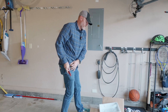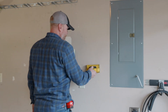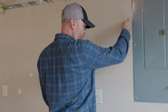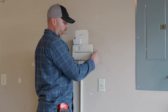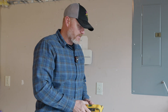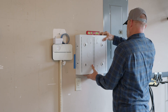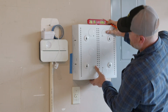Today all we're going to do is get this set and get the infrastructure ready. The first thing I typically do is verify that we've got enough room — this is 14 inches wide, so we've got to make sure we've got enough space between the studs to set this. We've got a stud here, and obviously the electrical panel has a stud right here to attach to, because these just sit between those studs. We don't want to cover up this area because we're still going to use it for our sprinkler box.